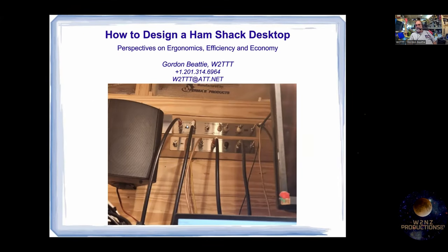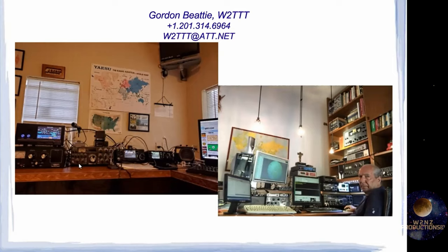This picture shows plates bonded through and grounded to the ground ring on the outside, and the lightning arresters are about two to three feet behind, down about six feet. It's a mess — I'm not proud of it. This other gentleman did a respectable job — kind of organic but nicer. He's got a much nicer countertop, and angular supports lagged into the wall so there are no knee-grabbing supports underneath. But the desk is shallow — probably two feet deep — and the Kenwood 820 ate all of it with no room in front. That's a problem.